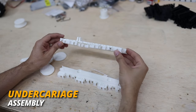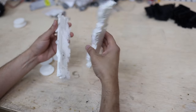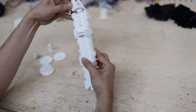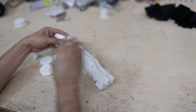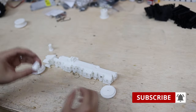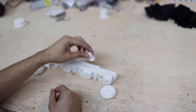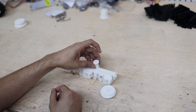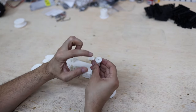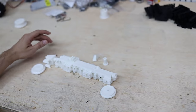For the assembly part I'm going to start with the undercarrier. We have here the undercarrier for the right part — we have right and left, and also the front of the part and the two wheels. This is for the track support, and this part is a separator that has a thread so an M5 can go here and join these two. Let's start with the assembly.